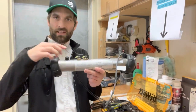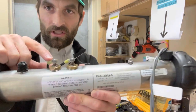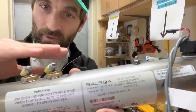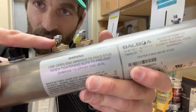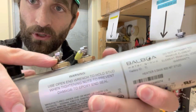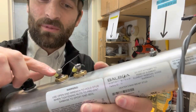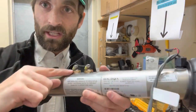Once the tube is drained and you've removed the sensor to have a better path of exit and entryway for the new element, it's important to note that you need to not only loosen the nut at the top, but you also need to hold on to the little stud underneath when putting the new element in. The elements should have a small nut there that you can hold on to — I use needle nose pliers. It's important to hold on to that, because as you're tightening the top nut, if you're not protecting it from twisting, you might be twisting the stem and breaking the filament inside the element, ruining your brand new element. So remember to hold on to that little stud at the bottom.